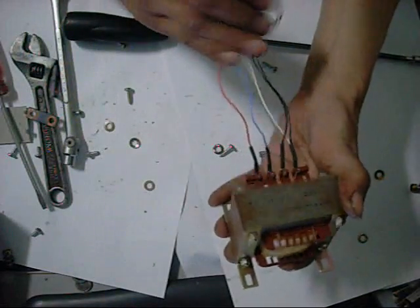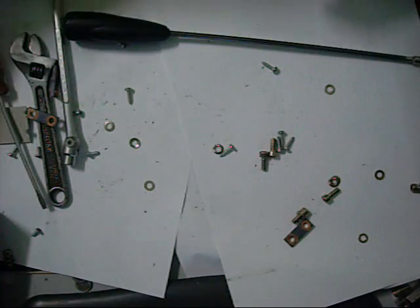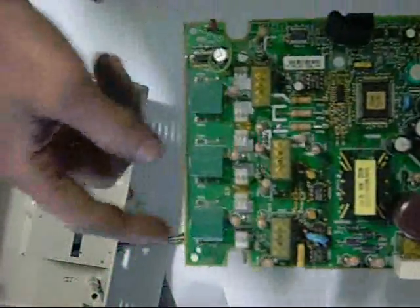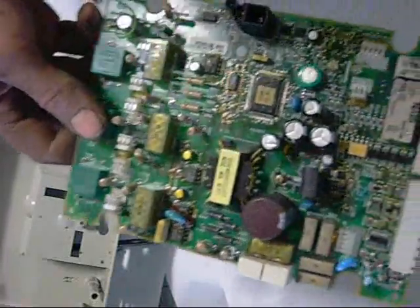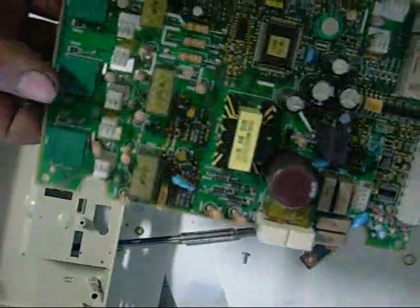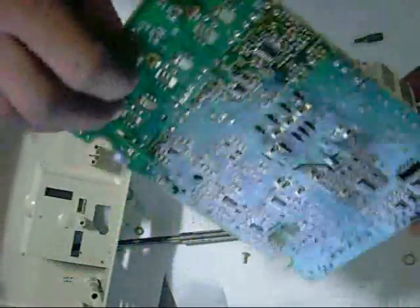Control transformer — I'll have to put some power to that and see what voltages I can get out of it. I'm guessing it's a 230 volt output. That's about all that's in the electronics box. The main board has three-phase controls going to the SCRs. There's the main power supply, a filter cap, and some 1000µF 25V caps. There's not a lot to it, but a lot of small componentry jammed into one thing. I'm not 100% sure how a soft starter like this works, but I'm pretty sure it's to do with the release of current through the thyristors.